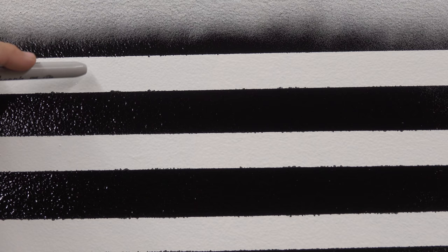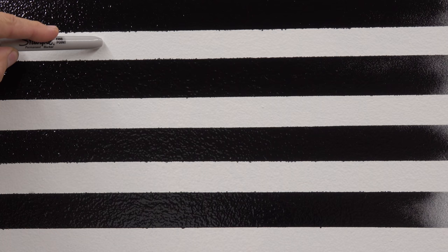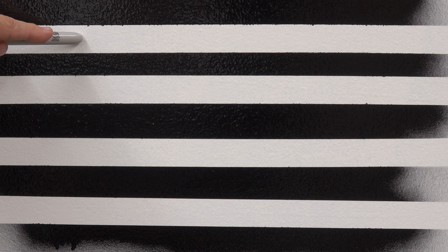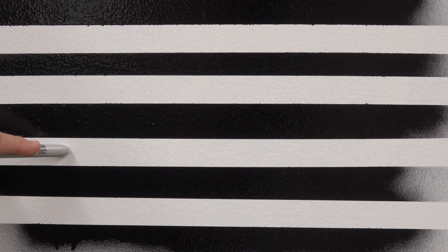With the roller, quite a bit of bleed through with Duck General, Stick Tech, and Duck Pro. Duck Clean again outperformed Duck Pro significantly. The Stick Tech Painter's Tape is slightly better than Duck General, Stick Tech original, and Duck Pro, but it's definitely not in the top five. 3M 2020 actually did very well this time. FrogTape once again finishes first, 3M Blue comes in second, 3M 2020 is third, and Duck Clean comes in fourth.